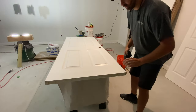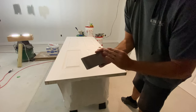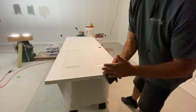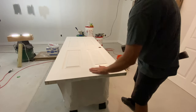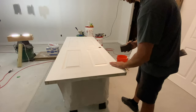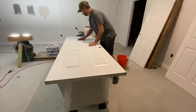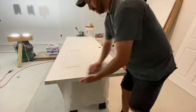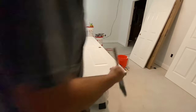All right, here's the key to the second coat. Take a sanding block, preferably one that you've used quite a bit. You don't want something super aggressive where it's actually taking the paint off, but you're just gonna feel little ridges from the first coat, little, you know, flecks of stuff in it, and you just wanna take all that off. Take a crappy brush and...